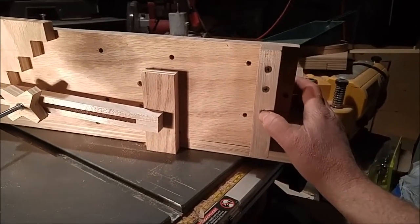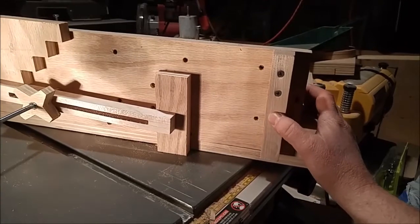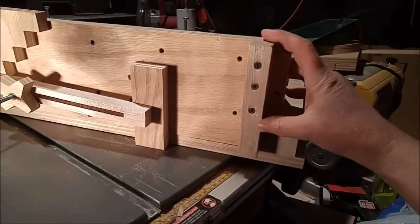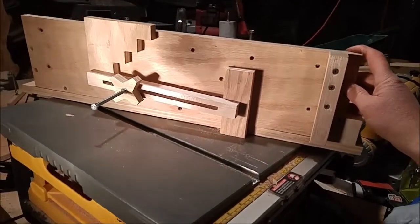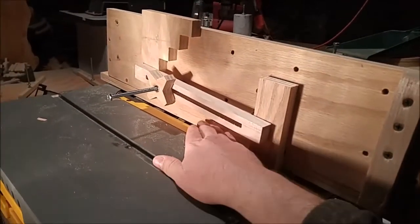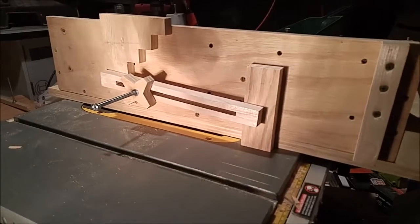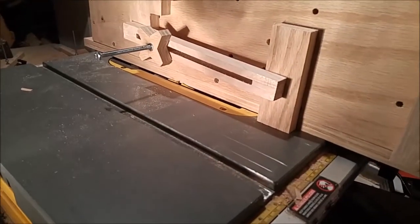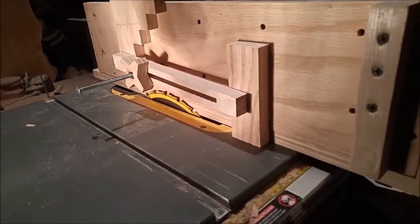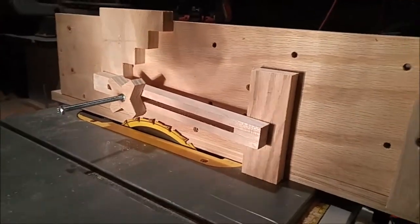This lower screw is above the maximum height of the table saw blade, so there's really no chance of hitting that screw. I just added several more screws to try and keep this as straight as I could. It mounts on this side of my table saw — this is a Dewalt table saw. The idea is that I can bring the blade up and then set a bevel angle. Right now I've got the bevel angle at 12 degrees.